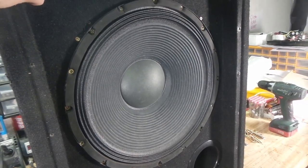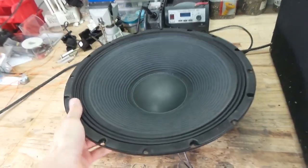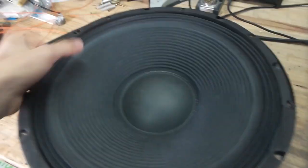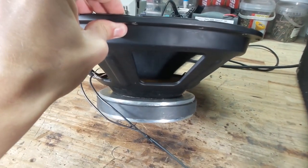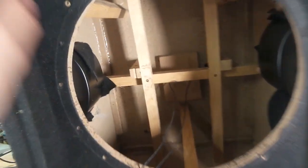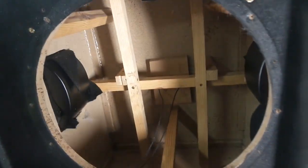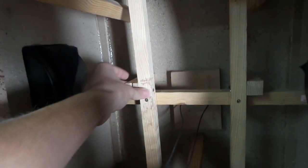So we're just going to take this apart and see what we can do. I just removed the speaker from the cabinet. Everything looks normal, although it does feel a bit odd. There's definitely something weird going on. The sound is definitely coming from the speaker, not from the box. By the way, all these pieces of wood, that's just internal bracing I added. It helps a lot with the flexing — it keeps the box nice and solid so you don't get any nasty vibration sounds coming from the box.